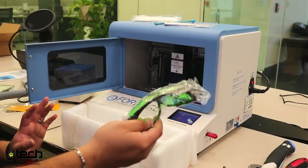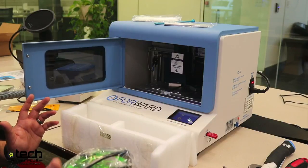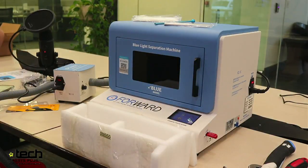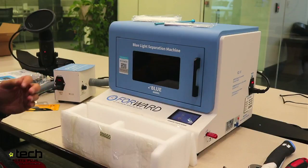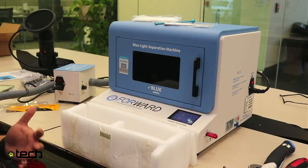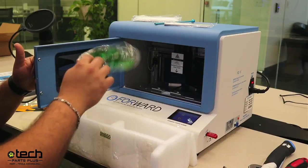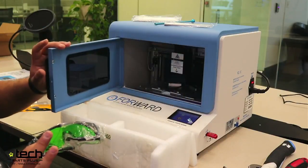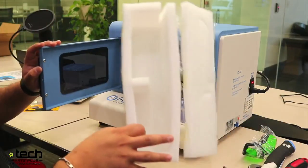We have safety glasses, which are two-fold. One, you can use them to protect your eyes from glass when prying it off. The main focus is protecting your eyes from the laser light. When the door is closed it's kind of like a microwave — looking at the light isn't going to hurt you, but it's not recommended. You don't want to stare at the light. If you have to look inside while it's running, use these glasses. I would absolutely not open the machine and look at that bare light without them. If something has to be grabbed, it's really recommended to hit stop or flip the power switch before looking inside.